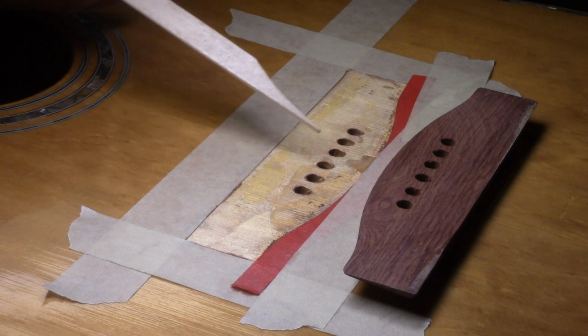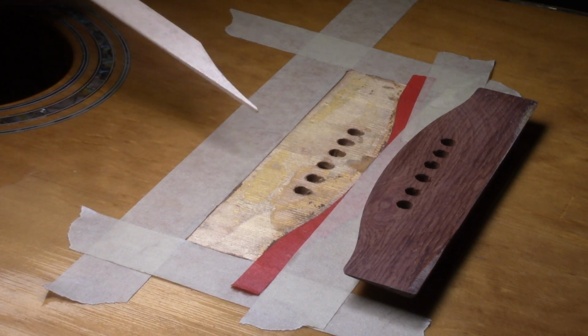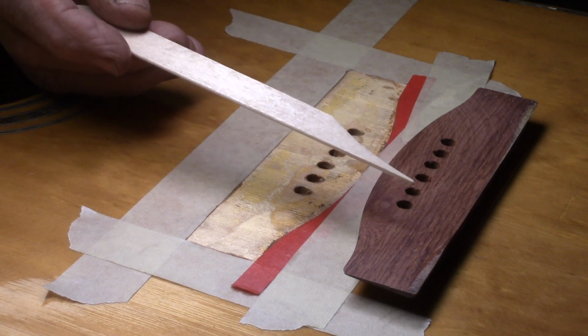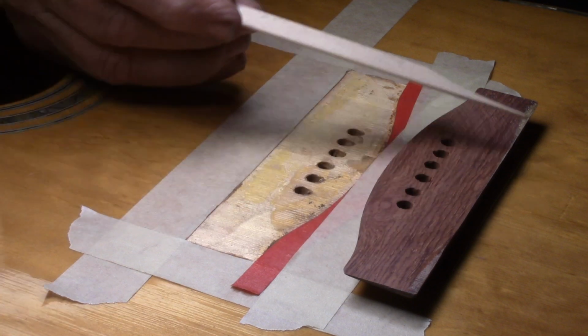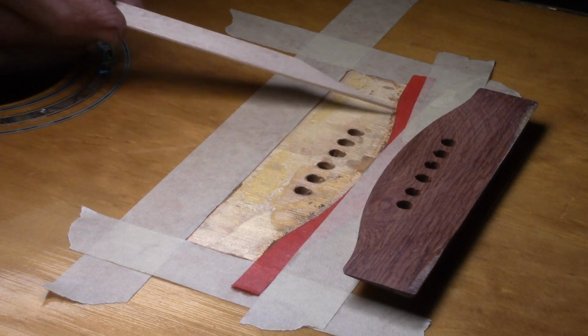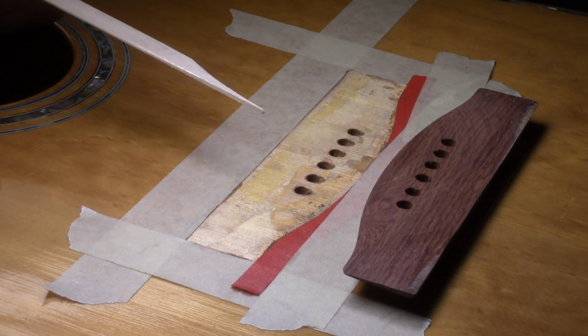This surface of the soundboard is untouched since I pulled the bridge off. The surface on the foot of the bridge has been radiused to a 24-foot spherical radius. I didn't chance going any further than this because the wings are so thin on this guitar. We're really going to try to cover up this original footprint as best we can.